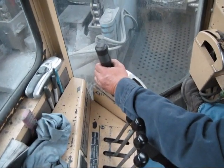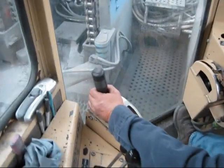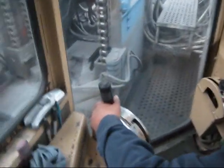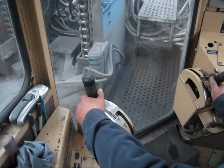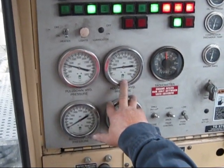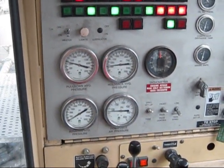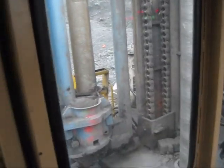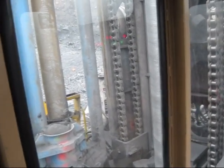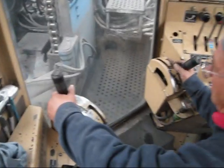I can actually change the settings and get out of this crooked broken rock. What about all the gauges — do you have to watch them? Well, you should. This is your air pressure gauge. That's your hold-back. Your hold-back works because these steels weigh two tons a piece. So as you add steels, you put two tons of weight onto the machine — push it down. So you'll use your hold-back to equalize that. If you drop two tons down there, you're going to destroy your hammer. Every time you add a steel, you have to add a little back pressure to hold it back, or if it runs away on you.